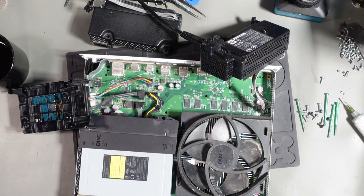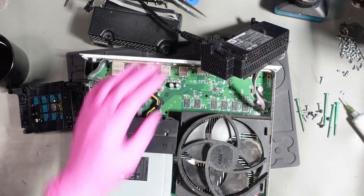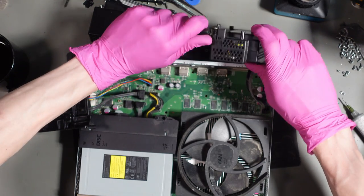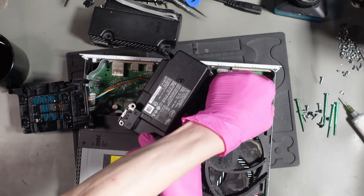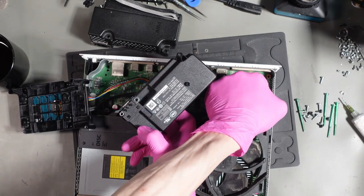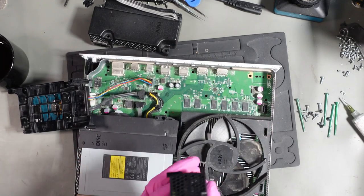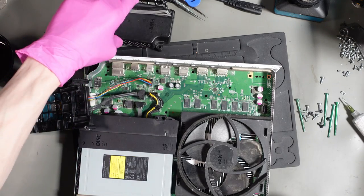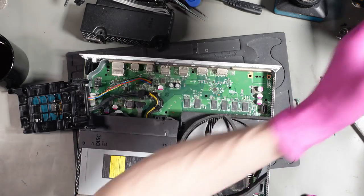No. Okay. So it's very rarely the power supply when we get a beep on beep off issue. It can be down to one of the capacitors inside the power supply. But again, that's not very often, to be honest. So the power supply is not the main issue. Whether the power supply is good is a different question, but it's not the main issue.